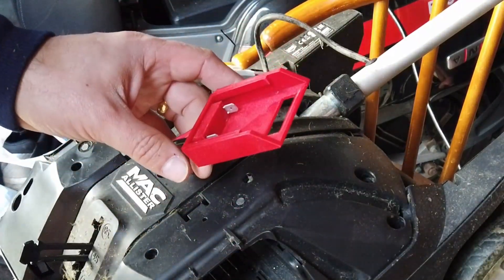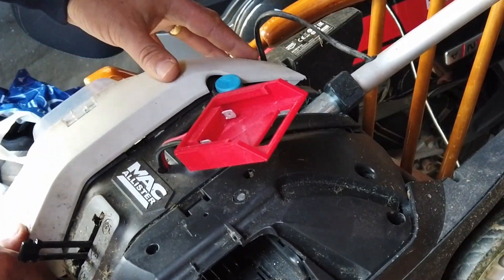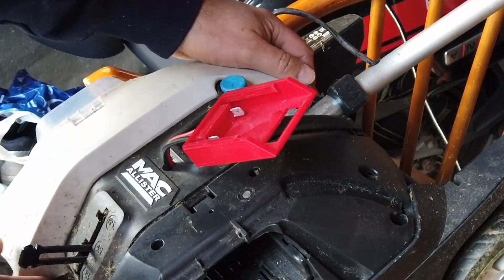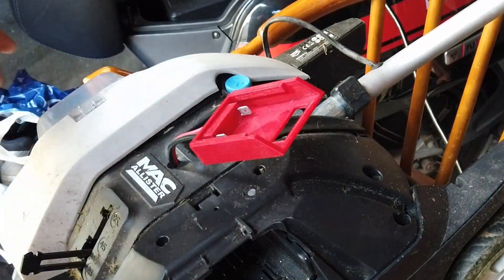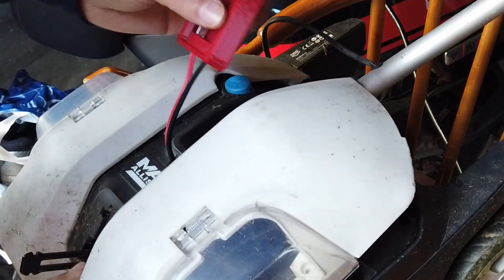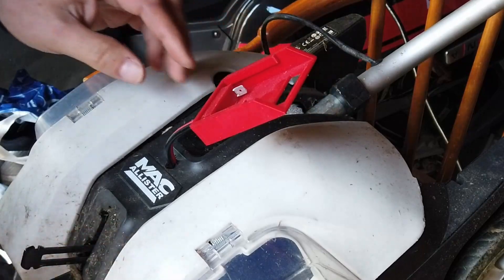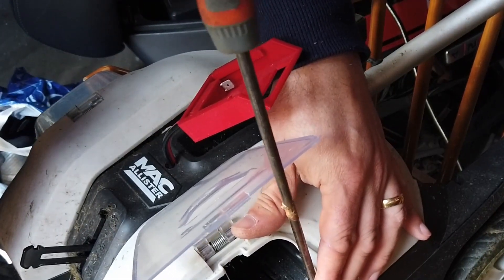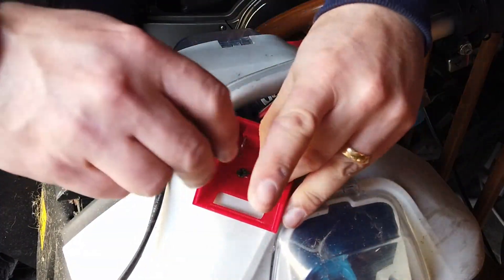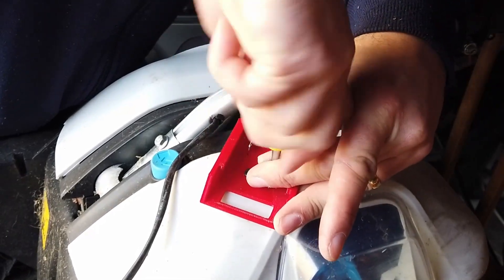We're definitely going to need the old battery to keep this system going. It is charging to about half capacity. And then we're going to add in parallel the newer EXT battery, which is a good-sized little 18-volt lithium cell. Now, obviously, two batteries in parallel are a little bit scary. You need to make sure they're both charged to the same level, otherwise one will dump power into the other. But ultimately, the mower works - it sees the temperature sensor on the old battery, and the new battery bolsters the power capacity of the old battery.